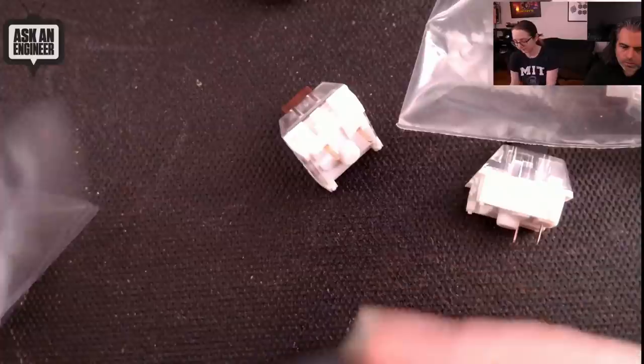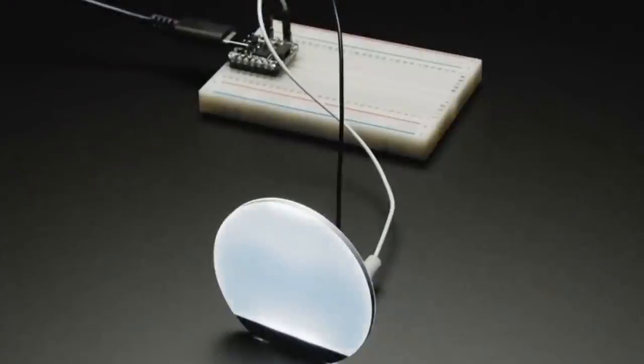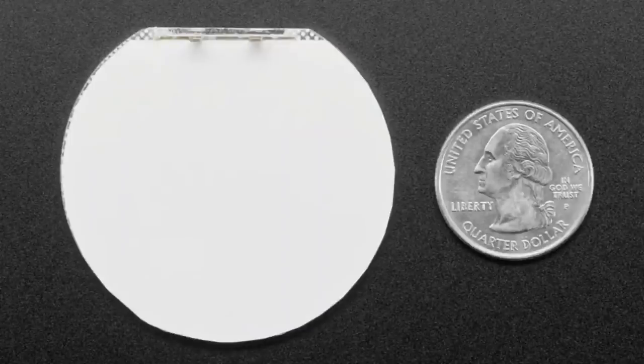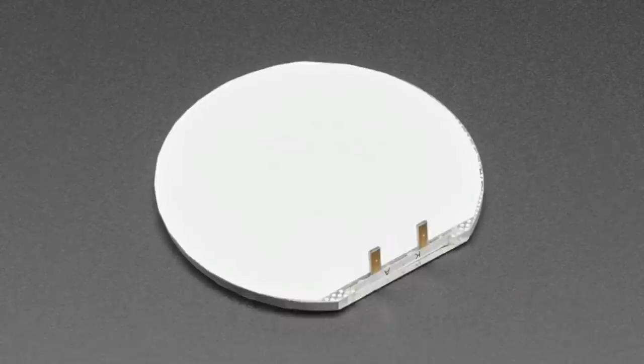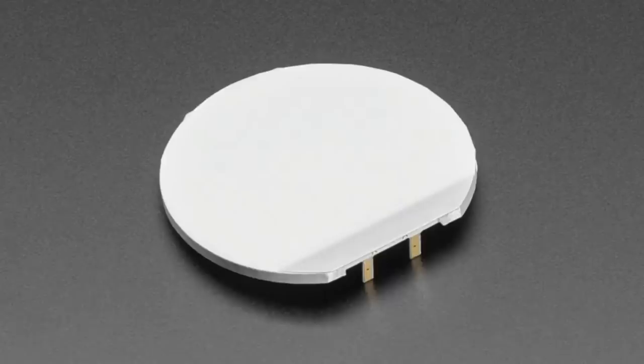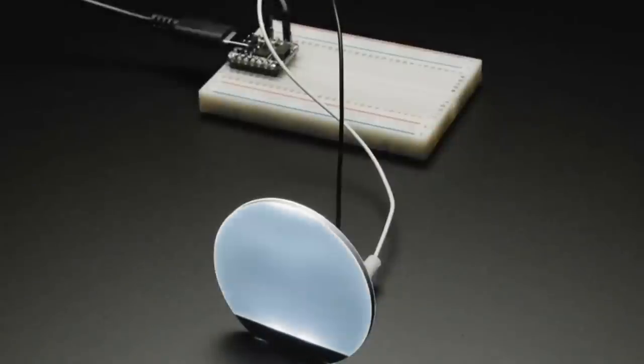This is an LED — we have strip LED backlights, and these are hemisphere ones. I think they're used for car gauges with LCD displays, though I'm not sure exactly. They're kind of cool if you want a unique shape. They have two LEDs in parallel, so provide them with about 30 milliamps. They look like a white LED — give them 3.3 volts and put a resistor in line if there's more than 3.3 volts going in. It's just an LED with a gigantic diffuser.